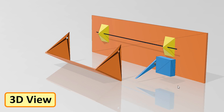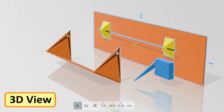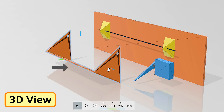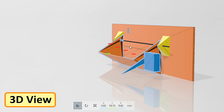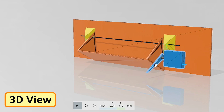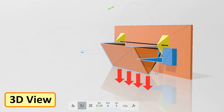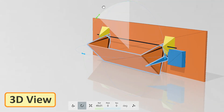Using a 3D model, I'm going to show you the design and working of the flower dispenser. The back bit sticks to the wall and using two holders it holds a lightweight stick, which in turn holds the front bit — the dispenser. I'm going to put all the rose petals in here. When the ultrasonic sensor detects an object, it sends a signal to the Arduino which rotates the servo, causing the dispenser flap to open and the rose petals to fall. The whole setup is made using a cardboard box, making it lightweight and easy to stick to the wall.